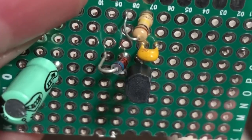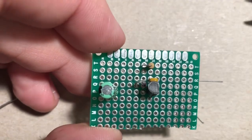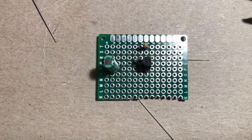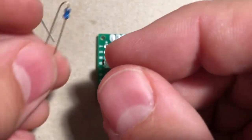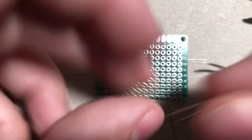All right, so this will just kind of come back to it later. Now, the top here, that's going to be going to your 9-volt power. The drawing doesn't have this, but I wanted to put a little power filter in there. So we'll just take the 100 ohm resistor. And what this is going to do is, when you get power coming directly from the wall wart, it'll kind of help get rid of some buzzing and stuff. It's not polarity protected because I didn't want to get too overboard with this really simple starter circuit. But this will definitely help reduce some of the noise.